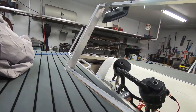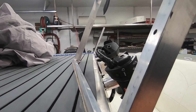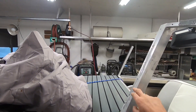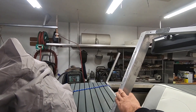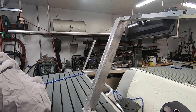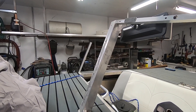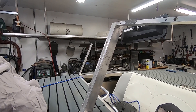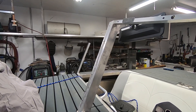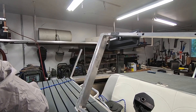One of the big ones is the windshield. The way I built this, I've got an angle here that I had to bend the plexiglass to fit and then bolt on — same here, had to bend the plexiglass as well. I really want to go to glass because the plexiglass, even after the first few runs, just kind of sucked. It tends to hold water, it's hard to clean, it's easily scratched.